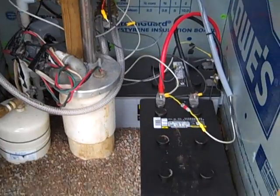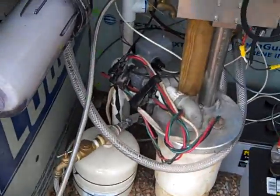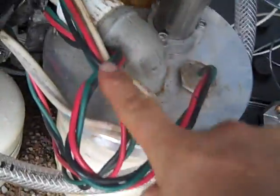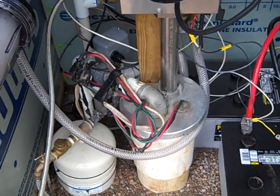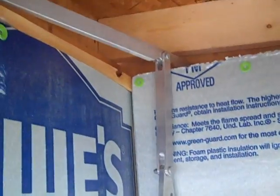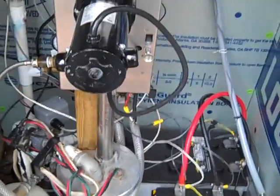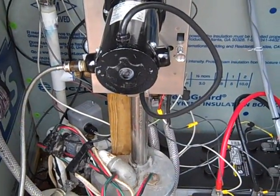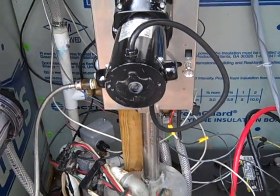This is a very tight space to work in, so I would have made it bigger, but this will give them an off-grid water pumping system. I also set it up so they can use the grid submersible pump to back-feed and fill that tank — if a fuse or solar goes out they can use a generator to fill the tank and run the Flowlight. We also have a hand pump handle in here: if things get really bad you can take the motor off, put the handle on, and back-feed the tank or the house directly.